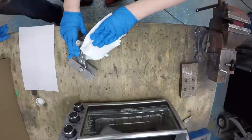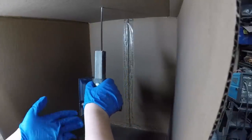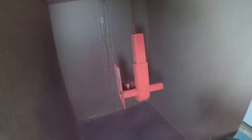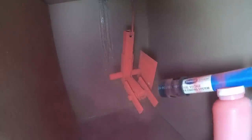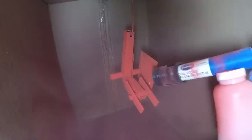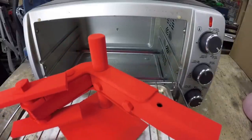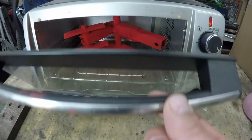The threads I made at the beginning were only to remove the looseness in the pipe. With my son, we washed it with acetone. I put a plate at the bottom — the white plate is not part of the tool, it's only there for support so it would sit flat in the oven. We used some powder coating — my son thought fire red would be a great color. There he is shooting the powder. We had the oven ready and it went for 15 or 20 minutes. We just sat there and watched it — it was pretty cool to see the color change.